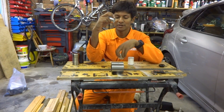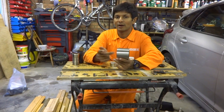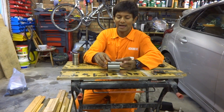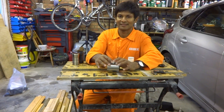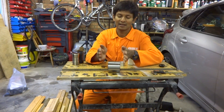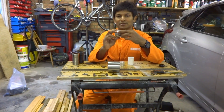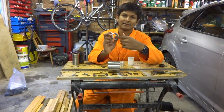There's not really much you can do about that if you're still working with a PF30 system, because you've got whatever hole Canyon, Trek, or whoever drilled in your bike. So in that respect you're pretty much stuck. However, most of the time you'll have fairly accurate bearing centre line accuracy. The next thing to look at is how the bearings fit into the cup and how the cup fits into the shell.